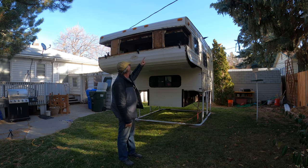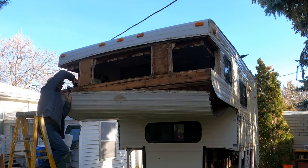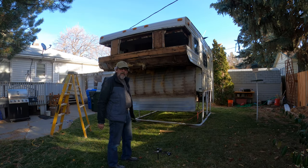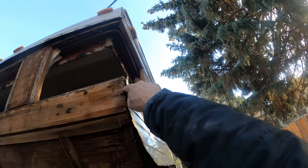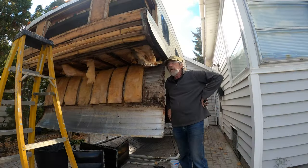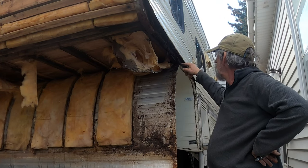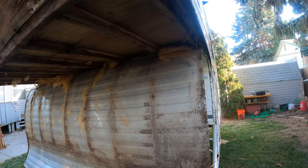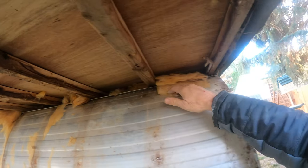I've already taken the front part of this apart to get a sense for how much damage there is up here, and there's quite a bit. These corners here were all rotted out, and it was leaking right here, so it leaked down in here. When I first pulled this off, this was just full of water — it's pretty rotten. You can see it's been holding water sitting on this tin here. This is still wet, just dripping wet. All this lumber here is rotten, so I'm going to have to take this back.